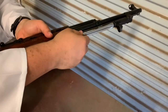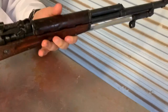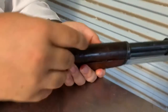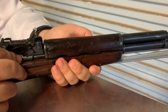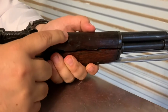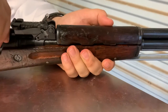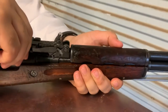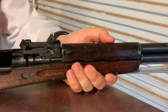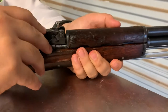The cleaning rod — we need to get that out to take the stock off. The way you do that is open the bayonet a little bit and walk forward. This is your gas tube — your upper hand guard and gas tube assembly. Also extremely important: this was packed so full of cosmoline I can guarantee this rifle would not have cycled. I couldn't even move the gas tube plunger — the short-stroke piston that operates the whole cycling mechanism — could not even budge it; I had to force it out with the cleaning rod.